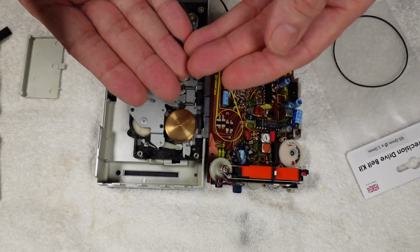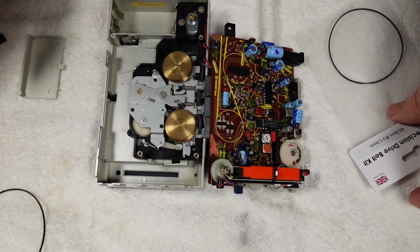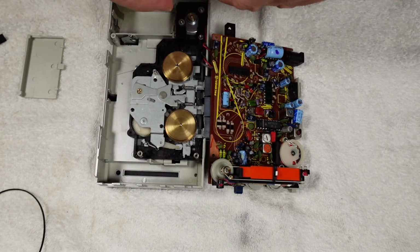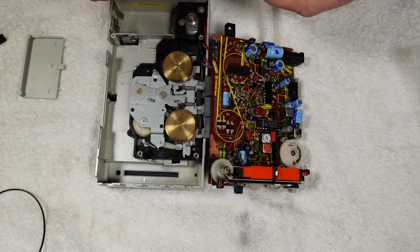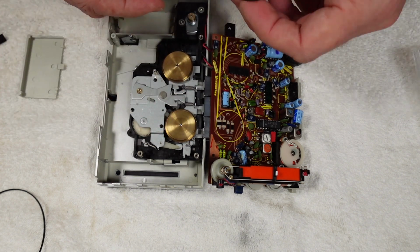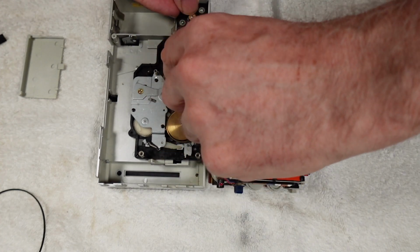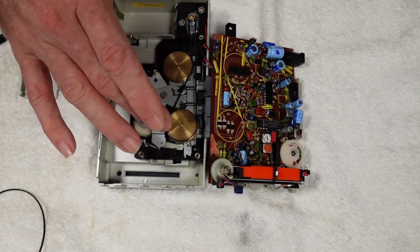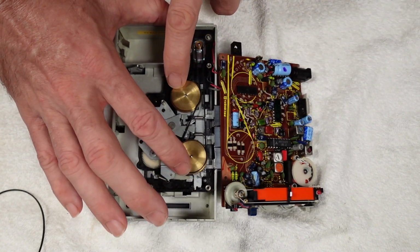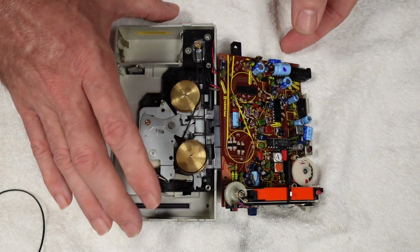As I say, these are well handy, keeping these cheap belts. They're not actually that bad actually, and they can sound really quite good. You can get some good ones, but obviously for decent kit, as I keep saying, and for things that are quite a lot of effort to get to, you want to have a decent belt in there. And there it is. So feels perfect, just enough tension on there, there's no slippage, but it's not too tight and it won't bind up the motor either.